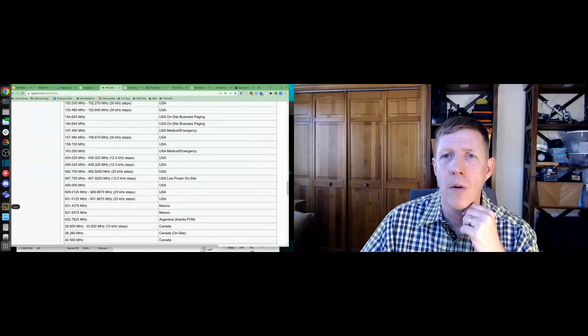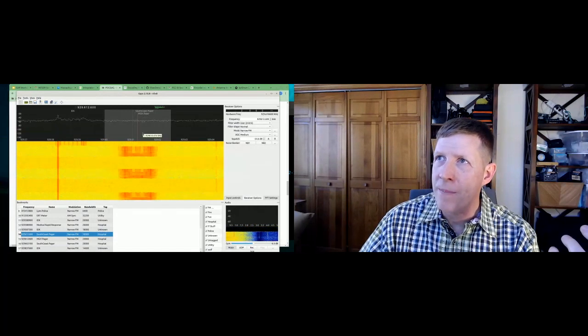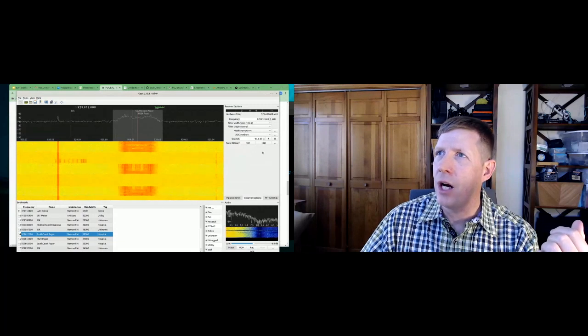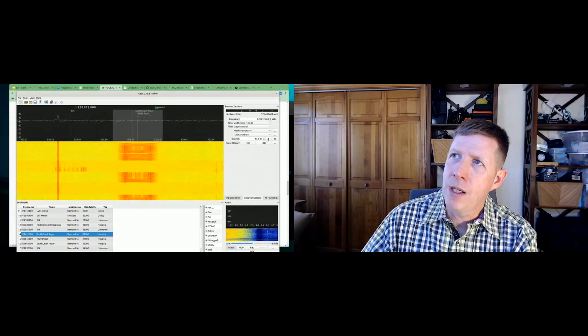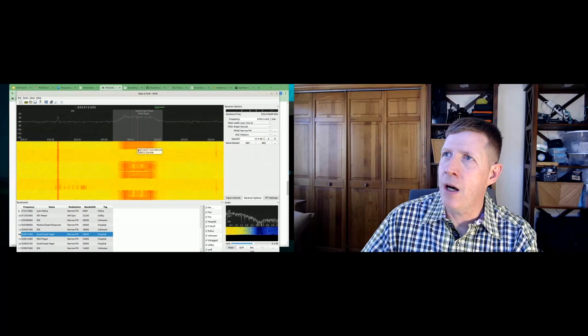So if you look at, I'm tuned to 929.61-ish. That's my center frequency. And you see I'm a little bit wide on the side, so I'm going to bring that back, right? So I get just the signal. The hardest thing is you wait until the signal goes away and then hit the auto squelch. Hit the A button here to get rid of that noise floor, right? And now you get these things.